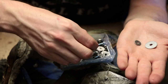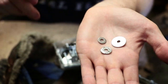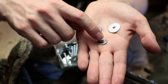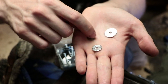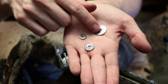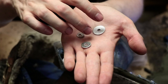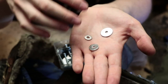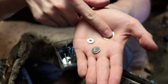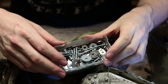Most of the time I'm going to use the medium ones — about 1.5cm across. Sometimes I will use the bigger ones, mostly for a visual effect. And sometimes I'll use the large ones either for a visual effect or when working in softer materials where I think the material itself is not strong enough, or when I want to be extra sure, to give it additional hold. Because the bigger the washer, the more material resistance I get — the more secure the hold of the whole bolt in the material.